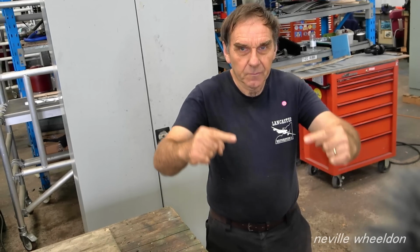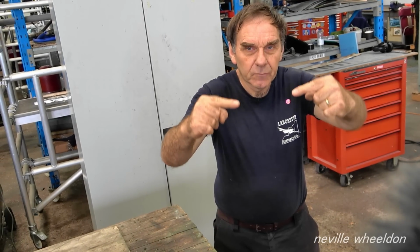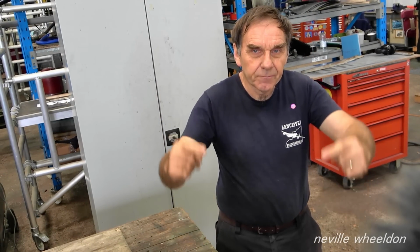We've found what Bob calls Manchester beams, which are used for taking wings on and off. It consists of two uprights and a steady underneath, which is moved up and down by winches on chains on the uprights. We've used them since the war, right up until the 1970s. So we've got to try and recommission them somehow.